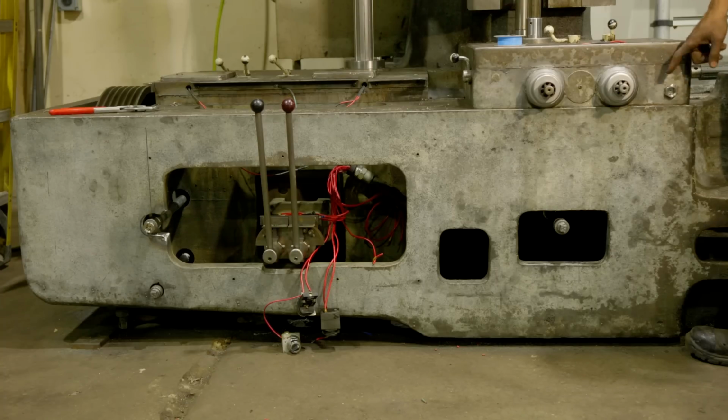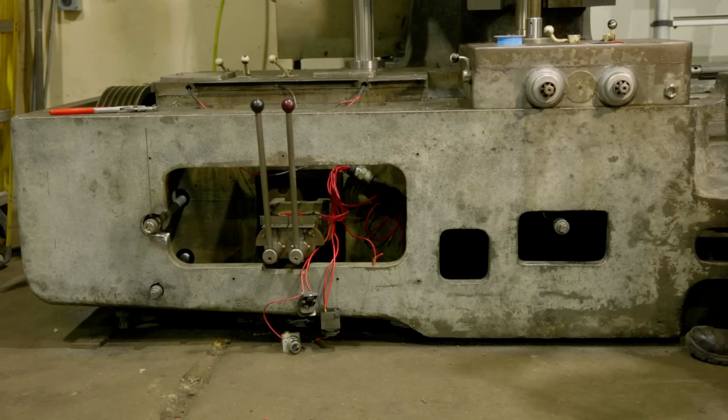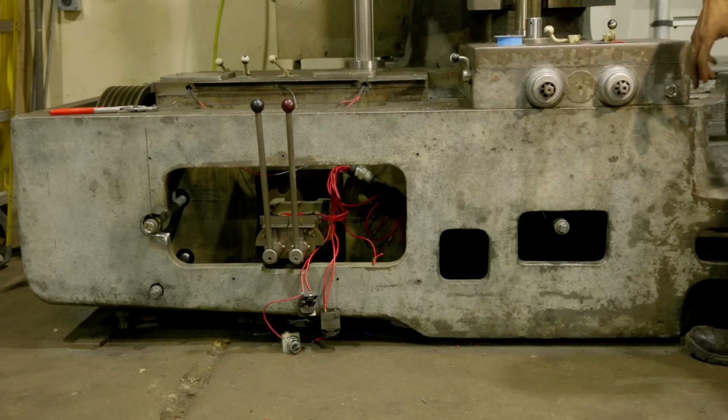A little bit extra work, but the main reason is the tap-in sights like I have up top, they do leak, and when they go bad, they're kind of a pain to change because you got to tap them in and like fish them out. These are really nice because they seal great, and if I damage them or if there's an issue, I just unscrew it, screw another one in, life's good. And that's a lot more standard and cheaper and easier to come by than the press-in ones. So that's the game plan on the oil.